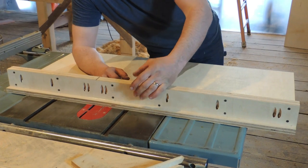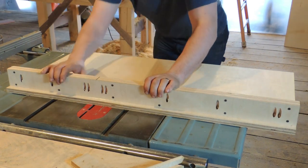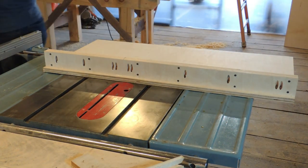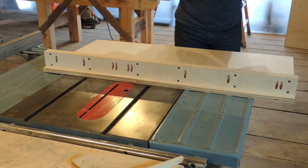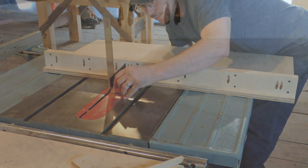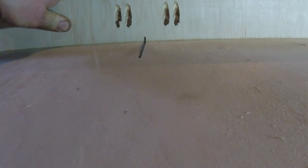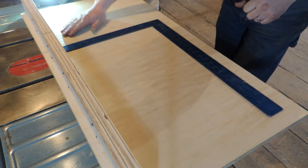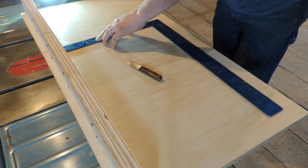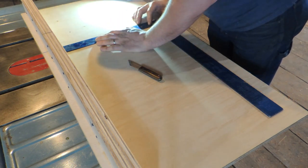That's more for looks and just to beef this front up a little bit. This is an inch and a half — it should be plenty strong enough. But I'd like something a little higher there to build kind of an arch over top of this where the boards are going to cut. What we want to do now is set the saw blade so that it just cuts — we'll set it at like an inch. All I want to do is just break through the top there a little bit.